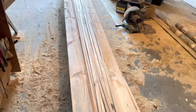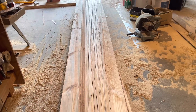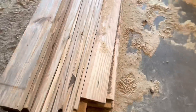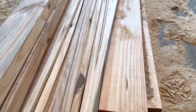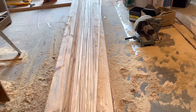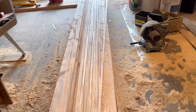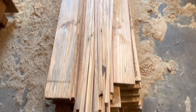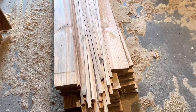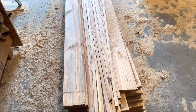All right, folks, that's stacked right there. That's going to be the false beams for that little house I've been working on. Still got to be stained and painted. That'll be that little thin trim I'm going to put right up against the ceiling, so it'll cover up any black cracks or something like that. You can't caulk it — it would look a little strange — so I'm going to just use that small trim to fill in the voids.